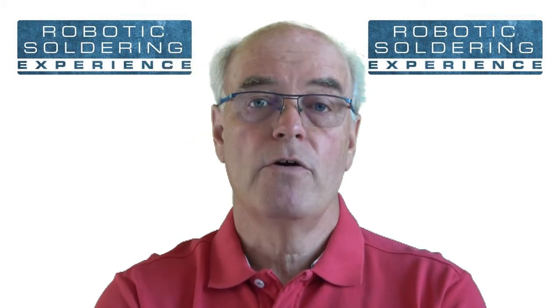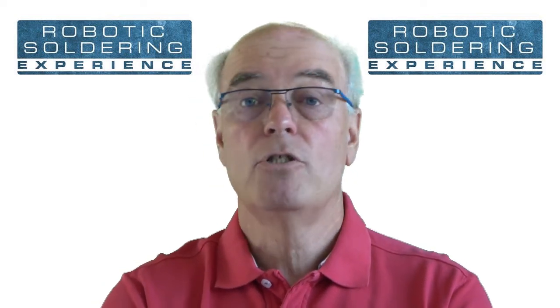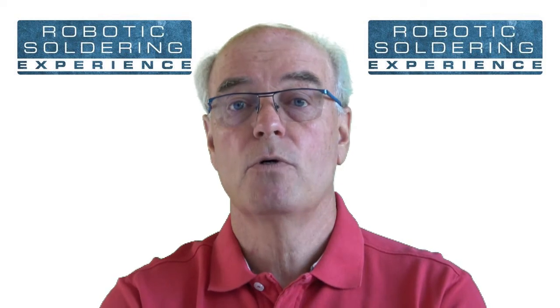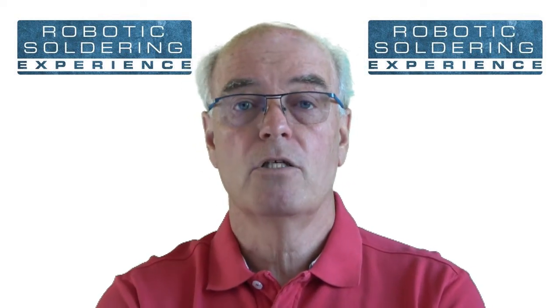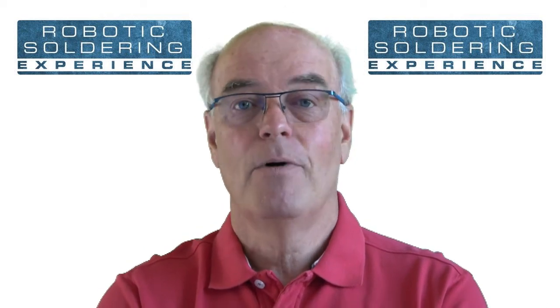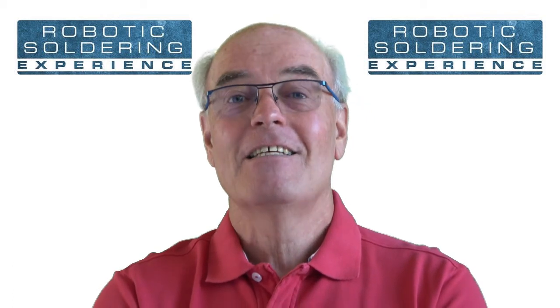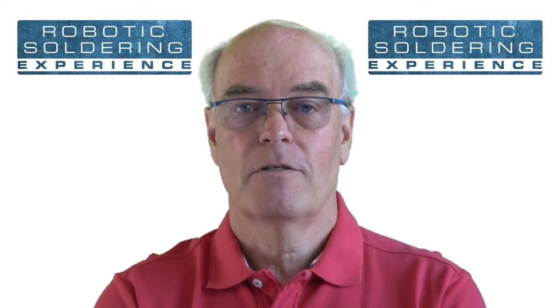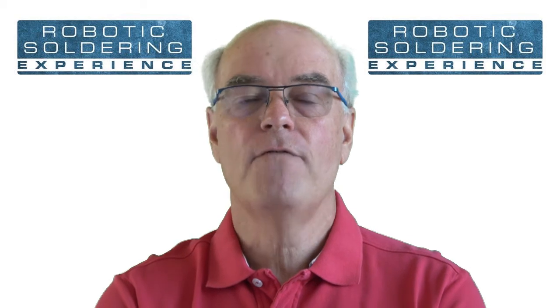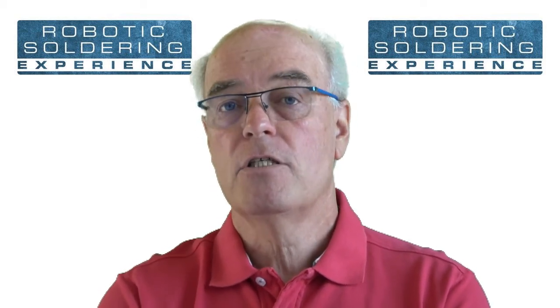One of the benefits here is we're adding heat to the whole of the printed circuit board. So if you then jump back into those two positions which were more demanding in terms of a soldering operation, which you can really only do easily by manual soldering or robotic soldering, then we can achieve a perfect joint.